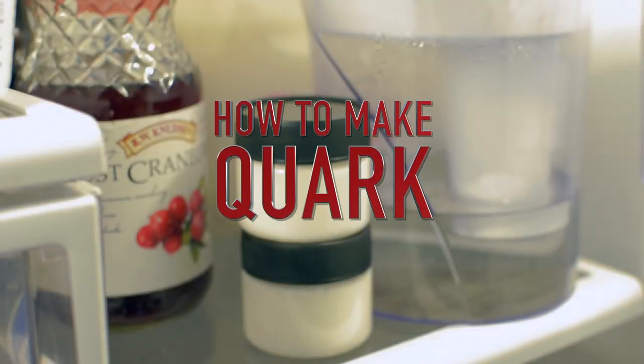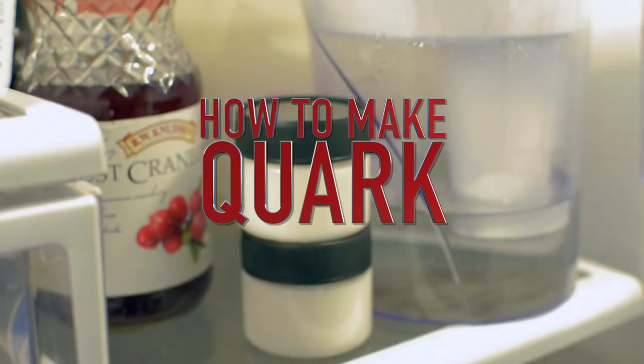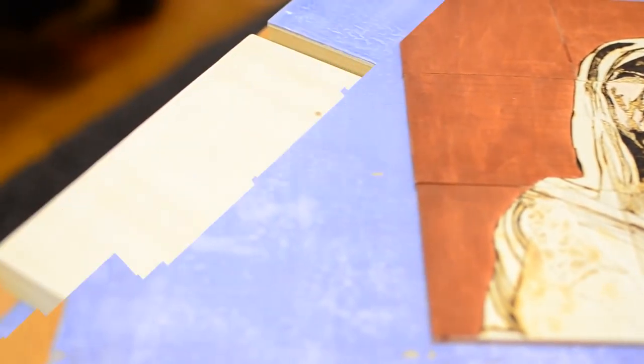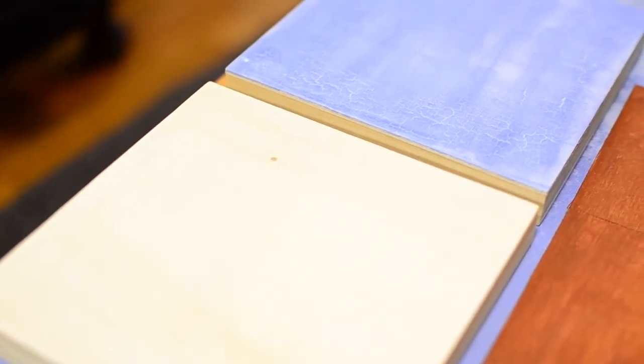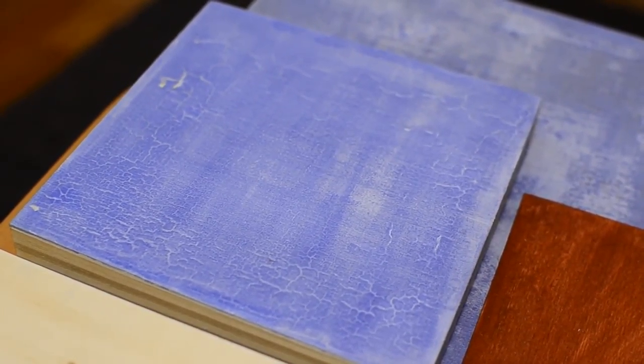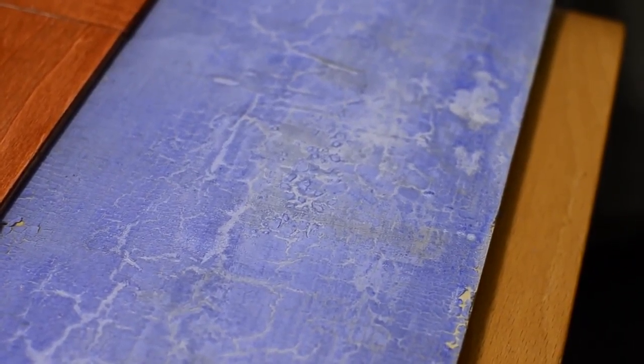Quark is the binder in milk paint. Here's an example of a project where I wanted the canvas to have a rough worn appearance, so I applied the paint on a board that had not been sanded and it actually had some residue of varnish on it. On a blank canvas where the wood has been prepared, you can see that the paint goes on much smoother, but for this particular project I wanted what looks like on the left — something that's much more worn and distressed. With milk paint you can have the same paint applied on different backgrounds or different types of canvases and have an overall different look.